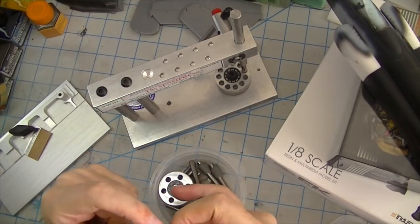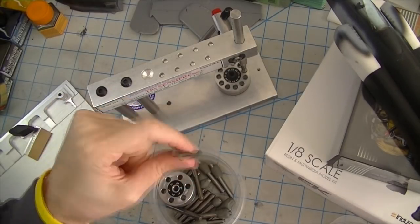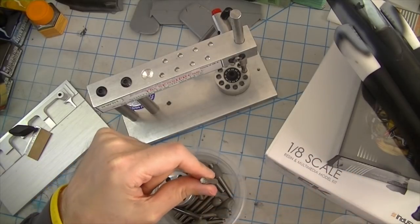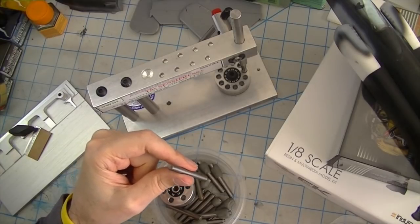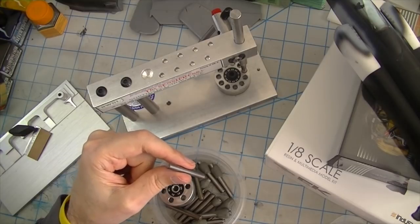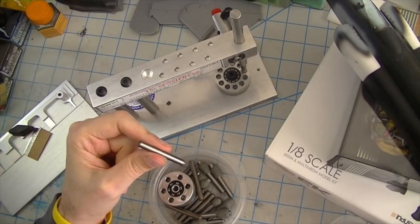And because you're using the small portion of the punch as the guide, now this thing can wave all around in the breeze and get jacked up when you hit it a little bit off center, as you inevitably will. And it represents a huge opportunity for failure or breakage. In fact, I know one of the guys in SMCG, Colin Arthur's, got a set of them where they showed up in the mail already bent and not even close to on center. So it's just a bad design.